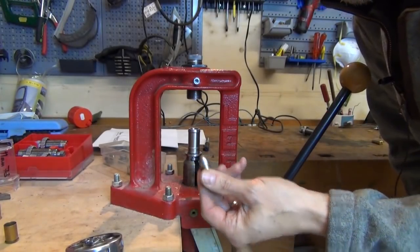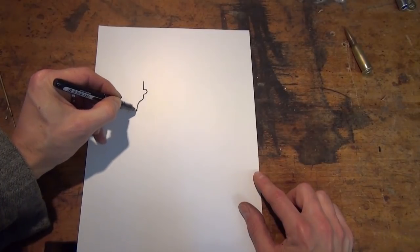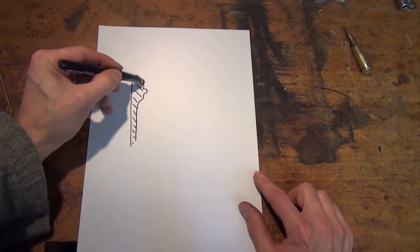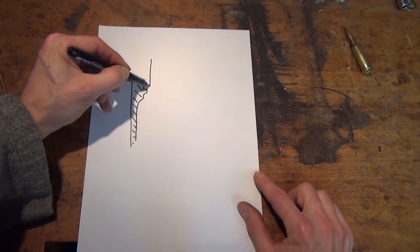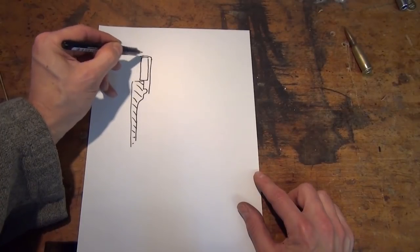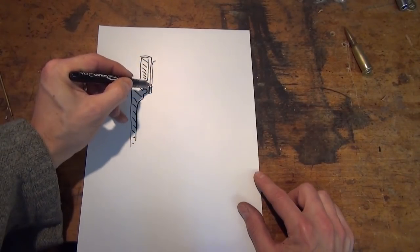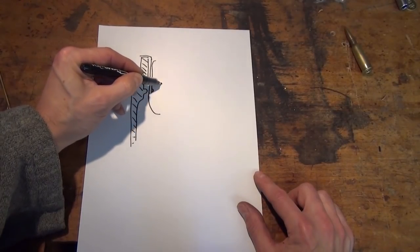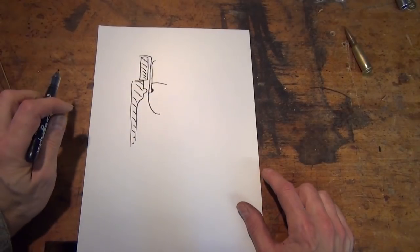So, mission accomplished. So just in case it's not quite clear what I've done, this is pretty much now what the cross-section of the collet looks like. So I've machined away top and bottom just to leave this little nub here, which forms the annular ring. And the case then comes to there, due to my little sleeve there to stop the case going down too far. And there's the case mouth, here's the heeled bullet with its little corresponding crimp groove, and of course when this pushes inwards, that forces the case lip here into the groove, and jobs are good.